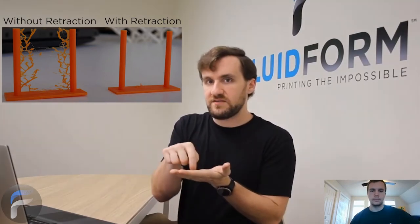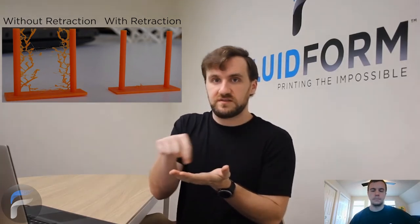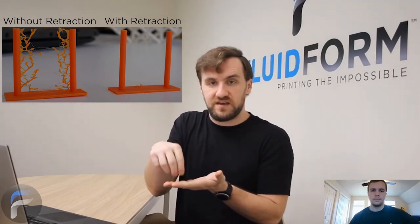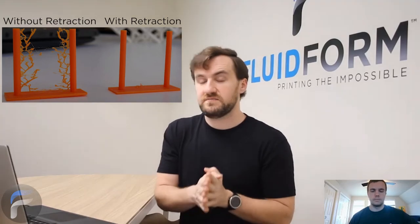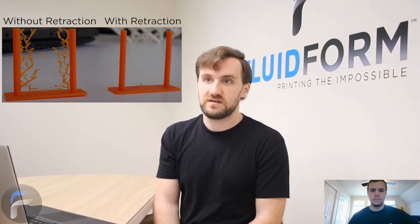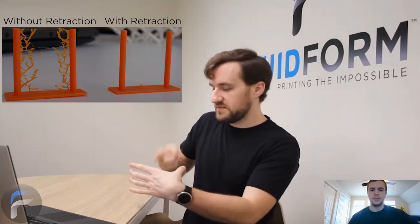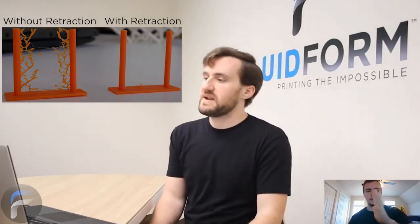When you're doing small details in a print — going back and forth printing little bits at a time, little islands — you don't want to leak between those islands, and you don't want to leak on the islands because it'll screw up the actual printing path. So you want to be able to stop extrusion, and that's why you need retraction. Retraction really works well on mechanical extruders — not all mechanical extruders. A syringe pump, meaning an infusion-style syringe pump sitting on a table like for a CT contrast injection that just pushes down on a plunger — those are not designed well for this.